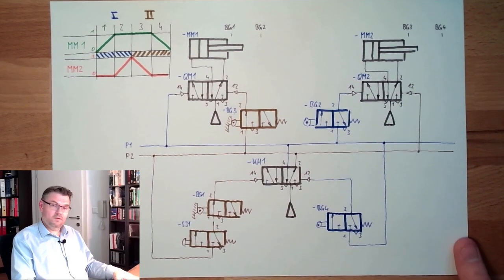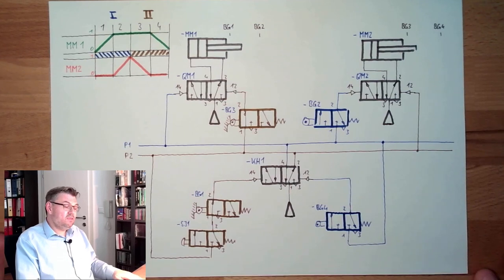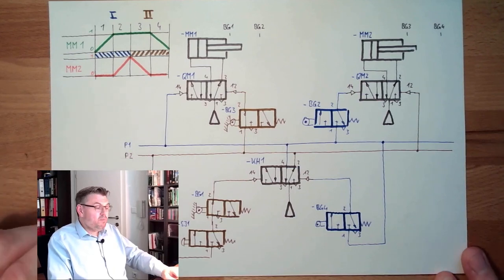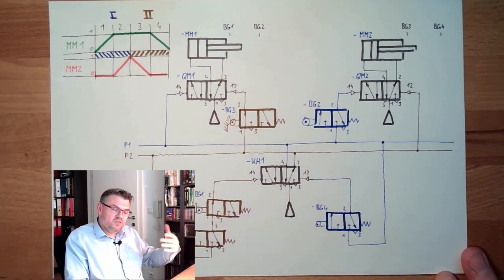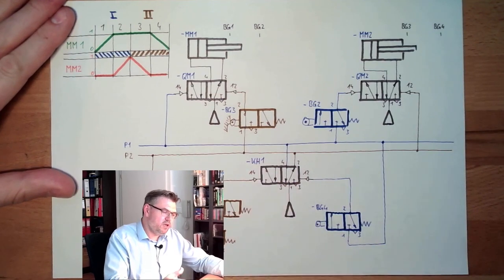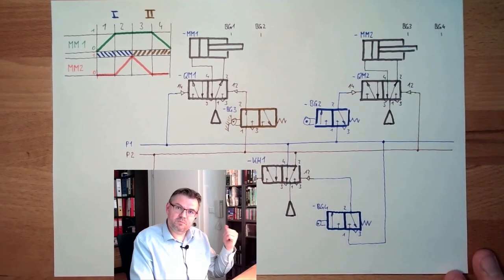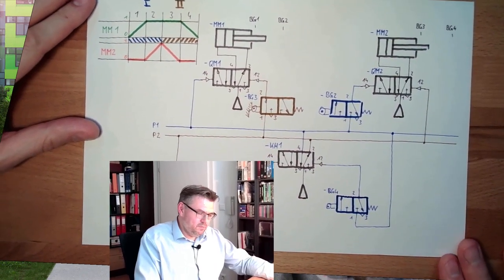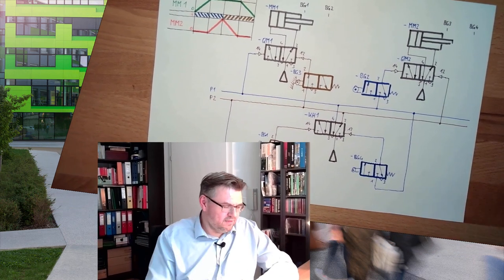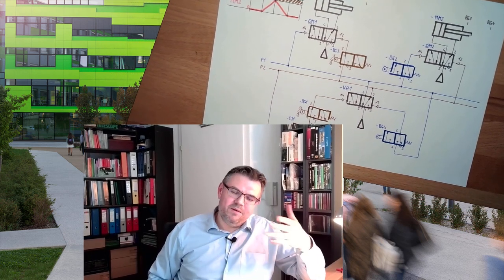Cascaded control — we divided our task into two areas, so the signals are only present when valid. If we use not one pressure line but four pressure lines, one for each step, this is called the synchronized chain. Then we have to store the information of which step we are in different valves, and each next step will turn off the previous pressure. We will discuss this further — there is a video about the synchronized chain you can watch, or wait until the playlist reaches it.